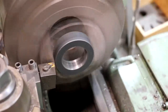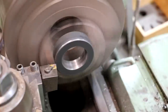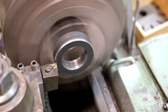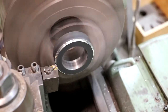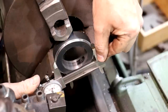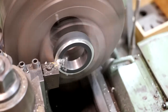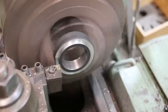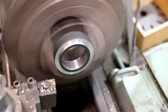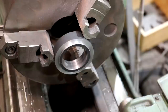This outside diameter is about three inches. I need for it to go into two-inch three hundred and fifty thousandths, so we've got a little bit to take out. I'm just going to make a little step, about like that - that's all I want. We're just going to cut that out. I'll put that in my digital readout and then we can just go to our measurement. This should be the right diameter. I think this first one is done. I'm going to go test fit it and we're going to make a matching one for the other side.